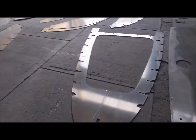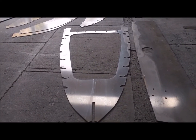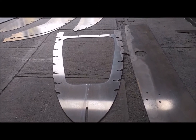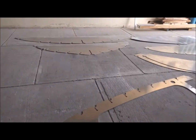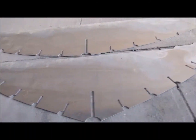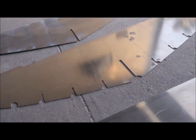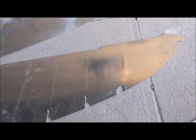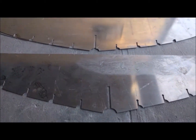Here's a good one that'll give you a sense of size and scale and change. So this is frame number two, back in from the bow. You can start to see how close it goes to a point at the bow itself for a wave-piercing style of hull. And then it starts broadening out more and more through each frame. This is number eight over here. You can see how we've got the markings etched into each plate so we know what they are, and then there's location markings that you can see if you look closely. And then this is frame number 13 over here — you can just see a different shape to the bottom as you move down the boat at different spots.